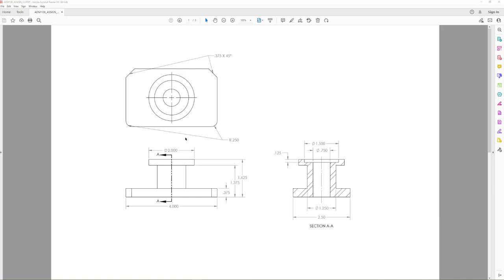With this orthographic representation, we're looking at this in straight-on views. We have our top view, front view, and then our right side view is a little bit different than what you've seen in the past — we've actually got a section view. If we took a hacksaw and sawed down the middle of this particular part, our eyeballs would be looking at this section on the left-hand side. When we flip our view over to the right-hand side, everywhere you see these section lines, that's where our little hacksaw actually cut material.